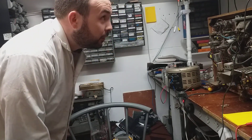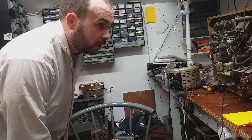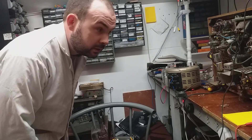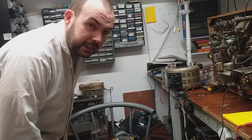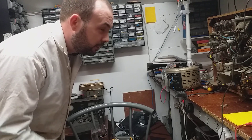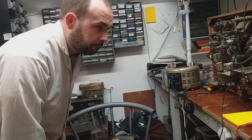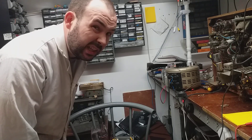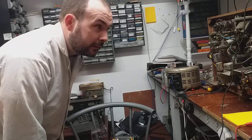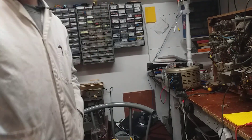Alright boys and girls, I'm gonna leave it at that for now. I'm putting the video up - it's quarter past eleven here, I'm a bit tired but we've gotten somewhere. We need to find out why it's blowing the fuse when you just plug it in. I'd say one of the electrolytes is just acting up - it's alright if you wind it up slowly but if you give her the full whack, she goes. We'll stick a nail across the fuse holder and see which one blows up - that's usually good for a laugh. Take care and all the best, talk to you again soon.